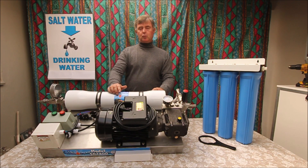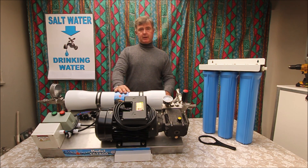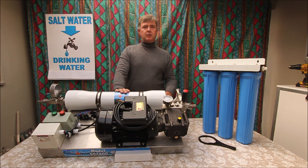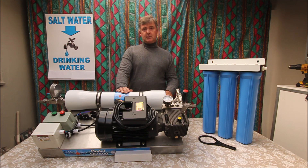Good morning. I'm going to talk to you about a small portable home desalination unit — it's called the SD 2800. It's mainly been built in South Africa and it is built for seawater. If you've got seawater and you can push it through here, you'll get roughly about 3,000 liters of fresh water in a 24-hour cycle. If you've got borehole water with salt in it, you can get up to 4,000 or 5,000 liters of fresh water, depending on your salt.